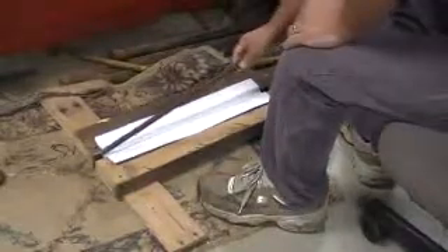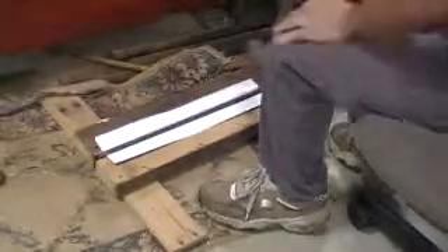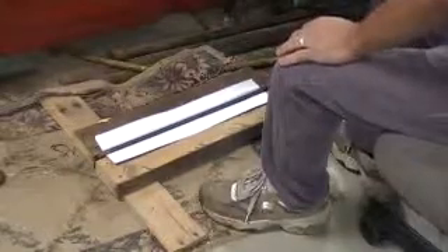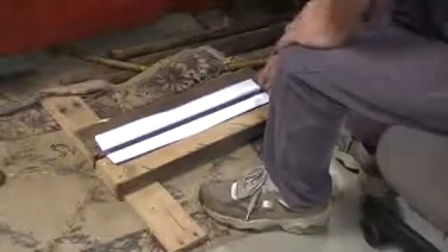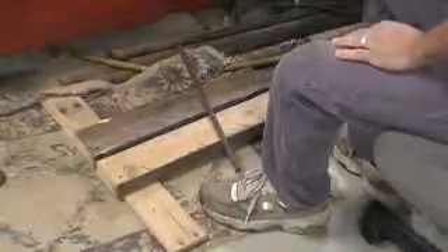You're just putting it onto the pipe prior to it being bent, and I'm just using a heavy sledgehammer to tamp that down. You're just pounding it down like that, and you end up with your curve when you're all done. It pops out — take your rebar out — and then you're able to lay this right over your pipe in your collector.